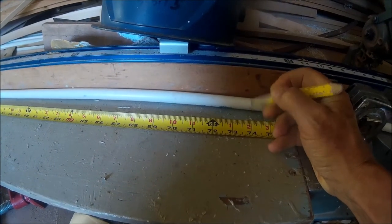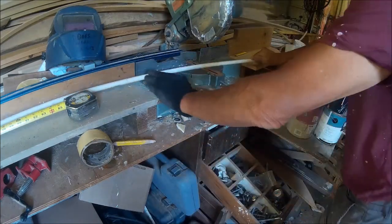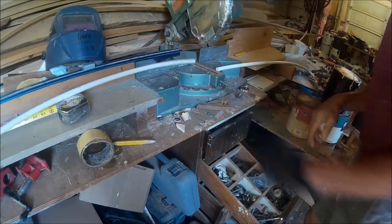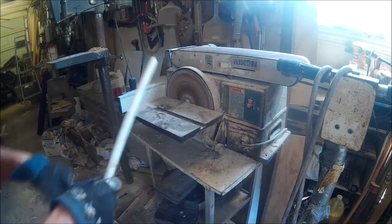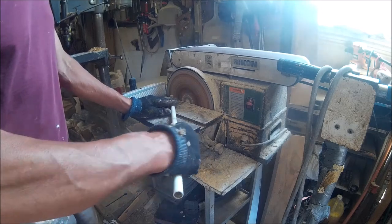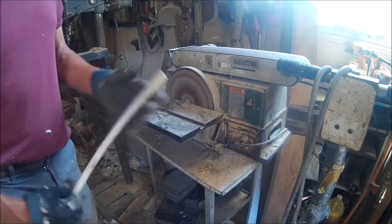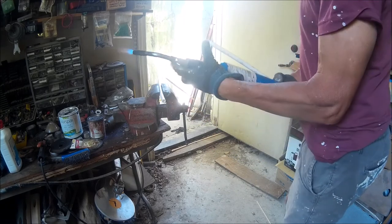Since I know I need it six feet, we're actually going to create a coupling, so I'm going to make it a couple inches longer so that I can make a coupling and absorb that piece into the other one. Let's go ahead and chop it. Remember to put your safety glasses on. Here we're actually going to taper the end of the drop piece of pipe — we're going to heat the other end with a torch, soften it up, and make our own coupling. We're going to taper it so that it slides in.